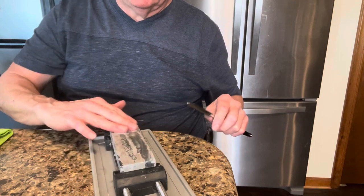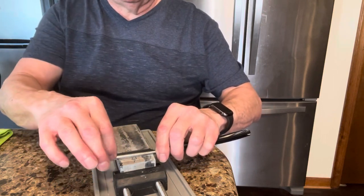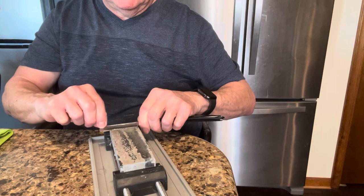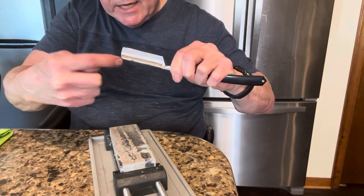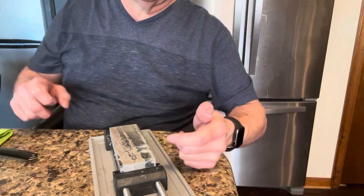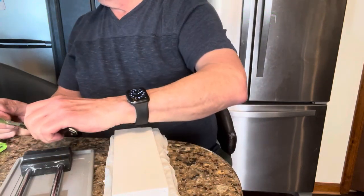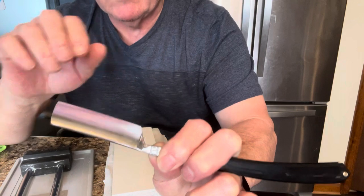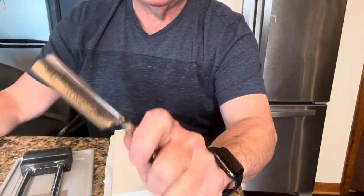I may ultimately go back just to the stone itself. What I'm going to do is use a rocking motion from fingers over, and I'm going to do this. I don't think I'm going to have to do this much to get what I call the back bevel, because I am working towards the back side of the bevel. I'm going to go ahead and do this a little bit, look at it, and I'll come back. I got really, really close to the edge. I look in the scope at 80 power and it's like I went almost right to the tip. You can kind of see where there's still some existing portion of the original apex there.